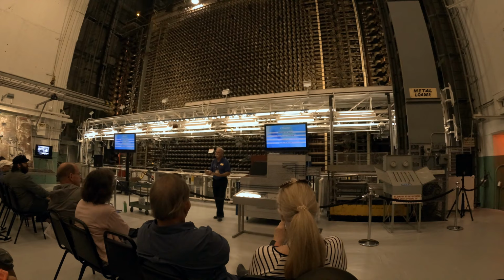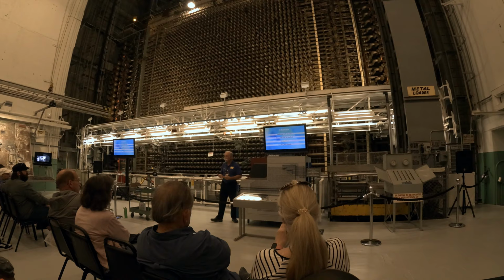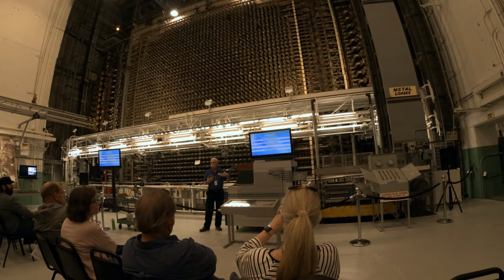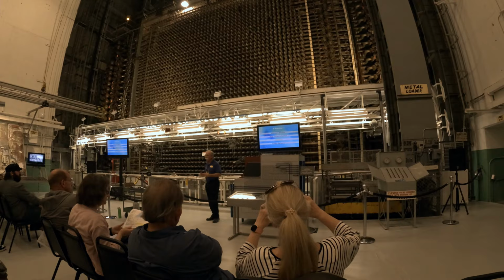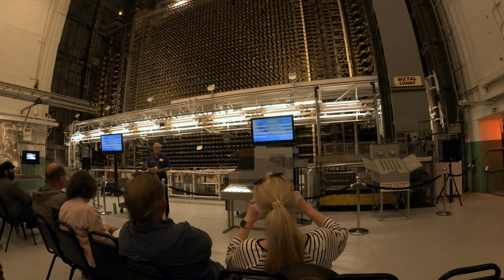So in the very middle is where the graphite is, and the process tubes you can see running through that, but there's a shielding assembly outside because we can't ignore that all that radioactive material that's going to be built in this fuel, they needed to shield their workers from that. So they put some cast iron blocks around the outside, and what that did was reduce the gamma radiation by 97%. Now that sounds great, doesn't it? 3% isn't a lot, except 3% of a big number is still a big number. So they wanted to take care of that.